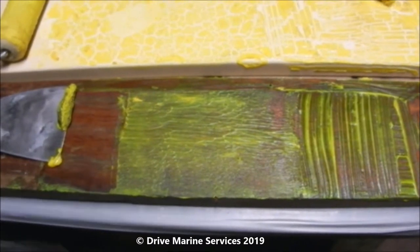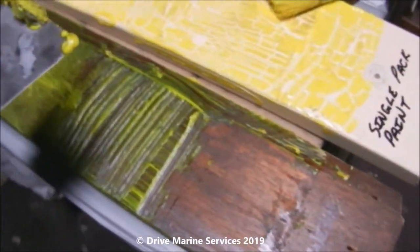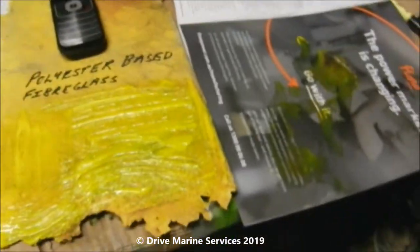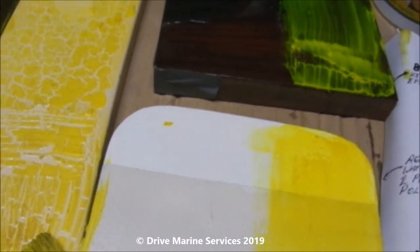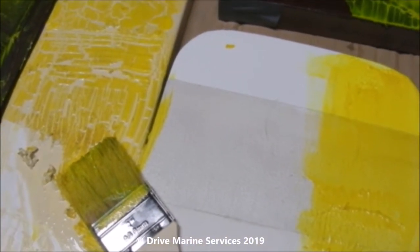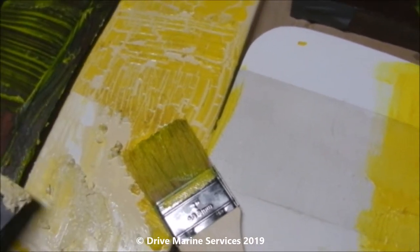Where we've got a thin layer of varnish there's no problem — it's lifting off easy enough. When you take it off, just scrape it onto some newspaper or an old magazine; you can fold it over and keep adding the stuff to it. Look at that — it's absolutely melted the top coat, it's like liquid. It's still very liquid and still wet; it'll keep working while it's wet. I'm just going to smooth that back on so it keeps working — it hasn't eaten through the undercoat yet, so we'll give it a bit longer.